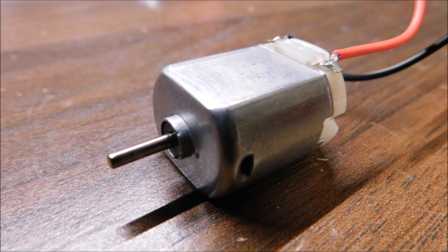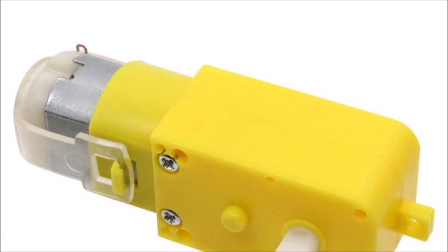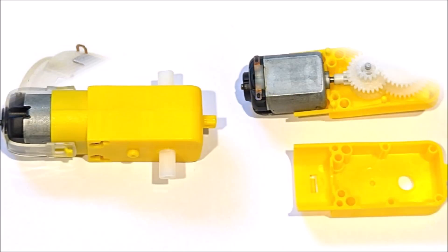I know it may seem a little bit small for the siren, but it's actually pretty suitable for it. I got this one from a 200 RPM TT gear motor. I will not be using any gears, only the motor itself, which works great for my STL-10. I highly recommend taking apart one of these cheap motors to get one of these, because they literally spin at the perfect RPM at 5 volts. How great is that?